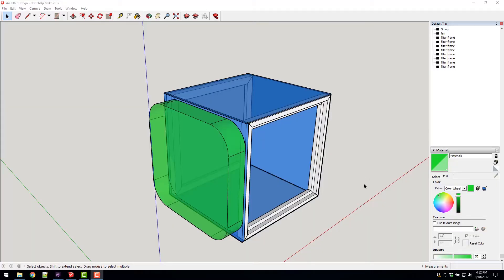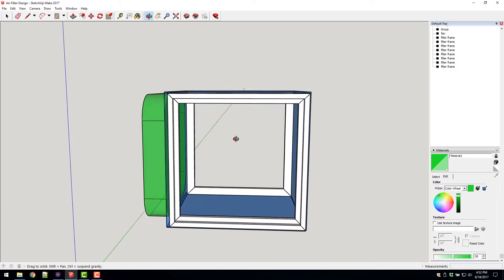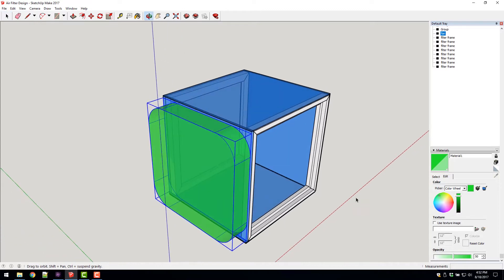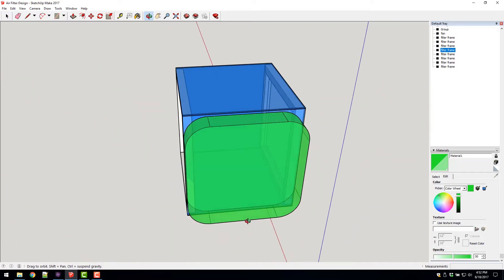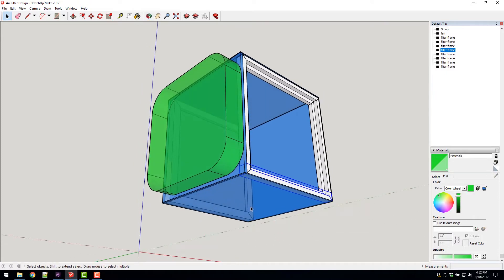Here's a look at the design I made in SketchUp before I started construction. You can see the sides where the furnace filters will go. This is the box fan that goes in the front. The frame is made out of 2x2s that are rabbited and mitered in the corners, and then the rest of the box is skinned with some thin plywood.